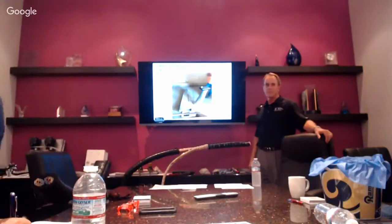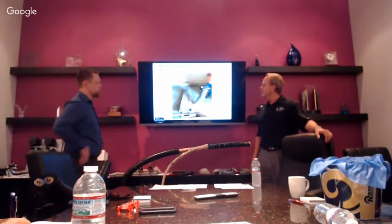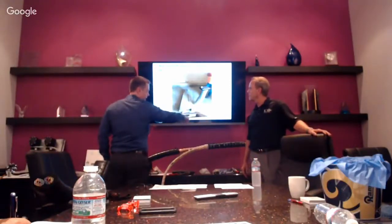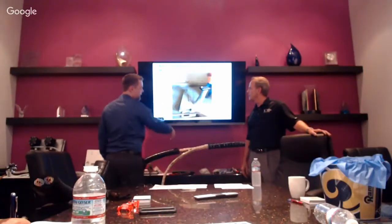So you're saying they cut it back to the curb and then you had to 90 it from there? Well, yeah, what they ended up doing is they jackhammered everything and part of the curb out and went straight down, because this radius was 2 feet underground where they hacked it off. And then they just left it there. And they backbored everything up to the curb, so the conduit was down there, it just didn't actually step up to the ground anymore.